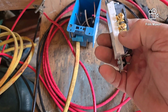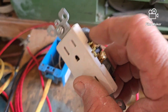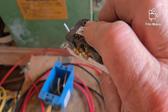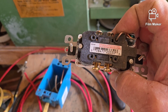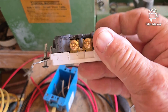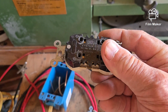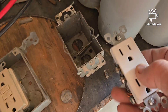If the ground were on the hot side and made contact with one of those screws, you'd have a problem. Another mistake beginners always make: they only use two screws — one for each wire — and leave the other two screws on each side sticking out. That is a no-no. I hate opening up an outlet in somebody's house and finding that. Those exposed screws are just waiting to cause a short. Take the time to screw them all the way in so they're not sticking out of the side of the outlet.